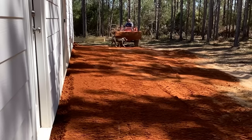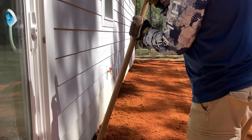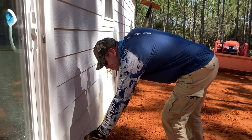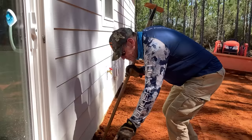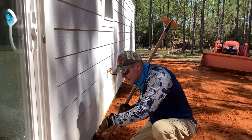The tractor tires won't pack close to the house because the bucket is wider than the front of the tractor — I don't want to hit the house with the bucket. Even if the bucket were a quarter of an inch away, the tractor tires would still be over here. So what I'm going to do is pack this with the end of the hoe, create all these little holes, then come back and put a little bit of fill dirt on top, take the bucket off the tractor so I can get closer, and really pack it good.